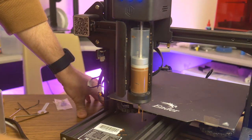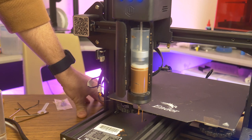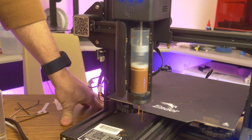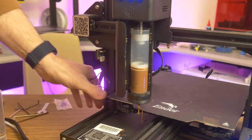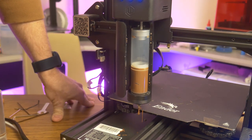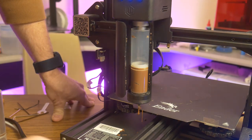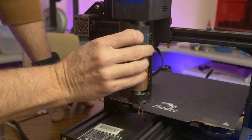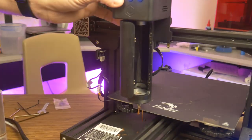The extruder is most effective with full cartridges. In my limited experience with this extruder, I have found that the first half of the chocolate cartridge tends to print without issue. But when you get to about the halfway point, something happens. Whether the stepper motor is too weak or the chocolate cools a little too much in the chamber, I'm not sure. But printing becomes difficult and inconsistent once you reach the halfway mark.